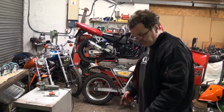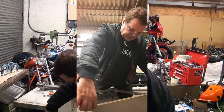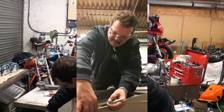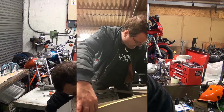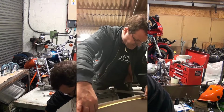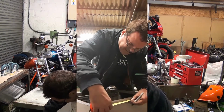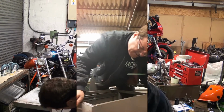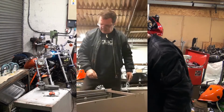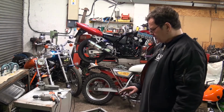Okay, next thing to do, having fitted it back in, measure it for rivets. So 22, middle's 11. Current two aligned. It's got 2 in that end. Leaves 9 in between, 6.5. And 4.5 from that. Looks right around the edge. And this is another reason I need to get this done, because it's going to have a 4-way on the side of it.